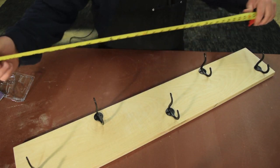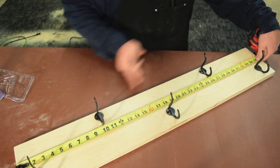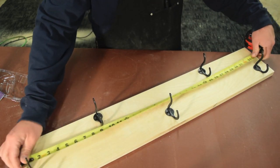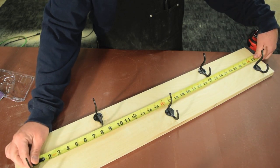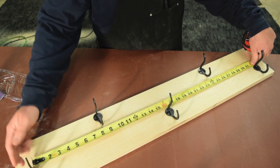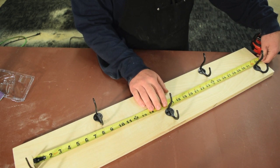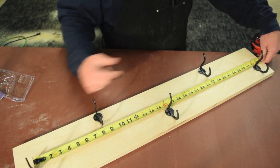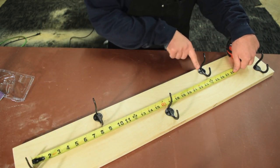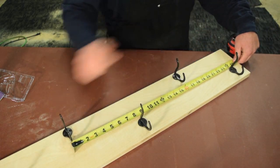Now we get to the part that makes this the perfect coat rack. When we set these hooks on those measurements, which I'll put in the description below, they're all divided in 16 or 24 inches apart. So for example, this hook and this hook are 16 inches apart, all the way down to this one that's 32 inches, so you'll catch 3 studs there. Or this one to this one are 24 inches apart. Or even this one to down here, 24.